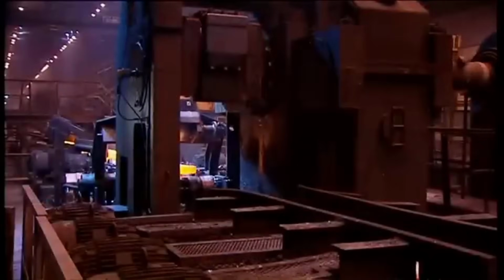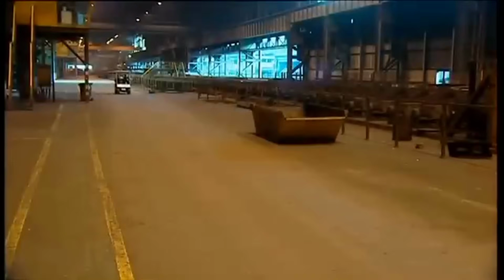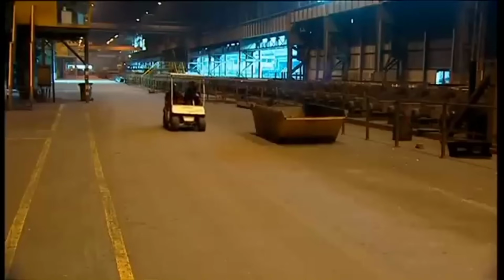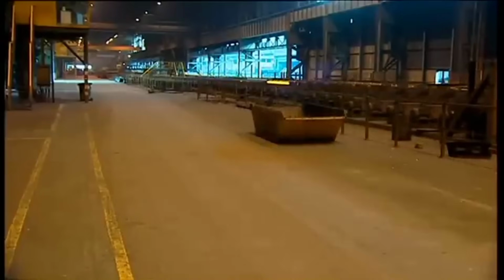Exiting the finishing mill, the steel encountered the billet flying shear, a pivotal component cutting nose and tail crops, shaping the steel into user-defined lengths based on customer specifications. The steel then underwent stamping, where an inline machine imprinted cast numbers on each billet, aiding identification and traceability.